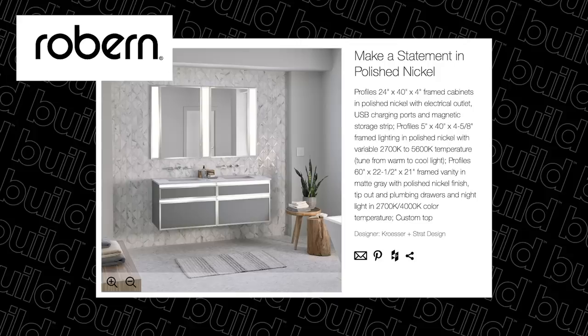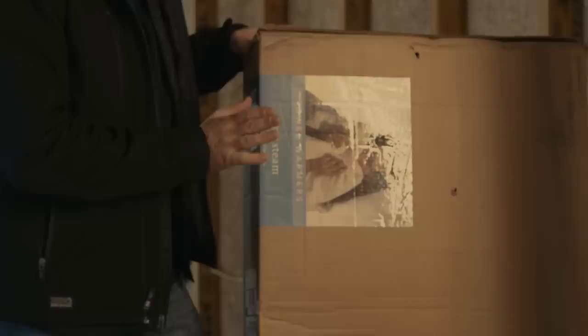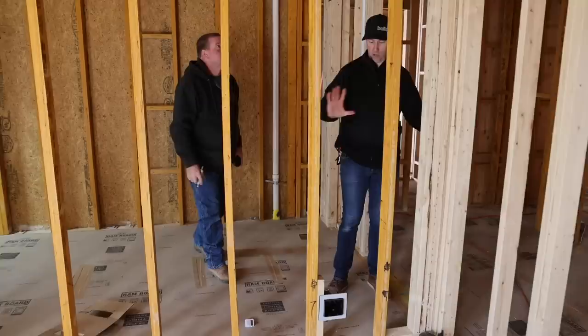And lastly, let's transition into the closet for my last bit of luxury that I added on my house that's getting wired up. This is a Mr. Steam towel warmer, and man, I'm excited about this. What this is is an oil-filled rack — it's kind of heavy, probably weighs 40 or 50 pounds. This is going to heat my towels and dry them quicker and allow me when I jump out of the shower — which is right there — to grab a warm towel. This is a direct wire fixture, and I also needed to put some blocking in. I need a couple of 2x6s or a 2x12 there so I can direct mount this on. Then Rick the electrician, when he sets this out at the final, will have this wire direct wired into this unit. I'm really excited about that.